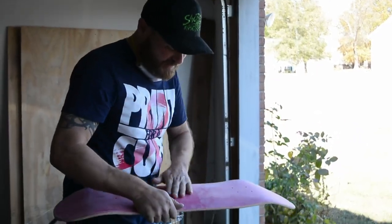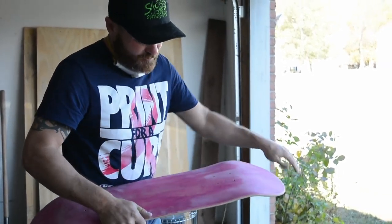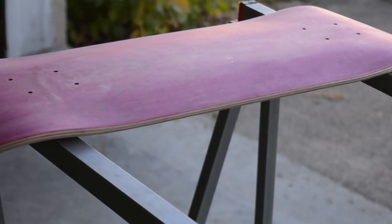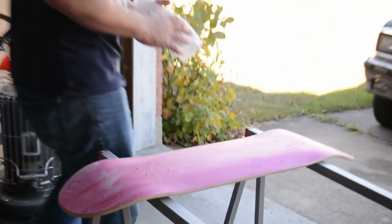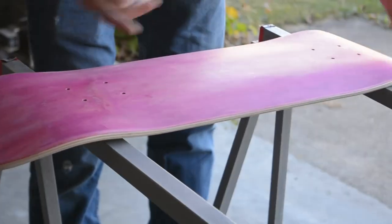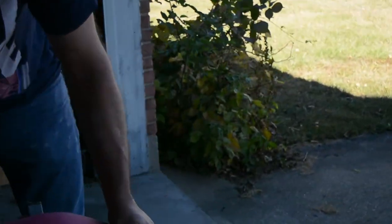All I'm trying to do is make it nice and smooth again. When I shoot that next coat of lacquer on it, it'll be just buttery smooth. I use a semi-gloss — it's not super glossy, and it's not satin or matte, so you're kind of in between the two. I'll take a tack cloth and just go over it. This will pick up all that white dust, which is the previous coating of lacquer that I put on.